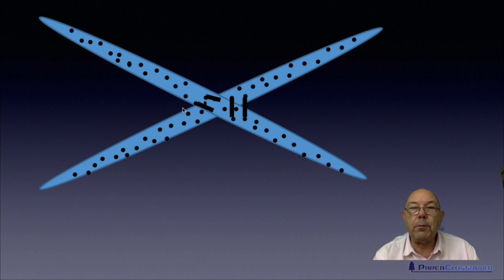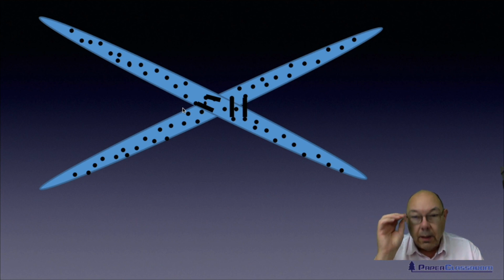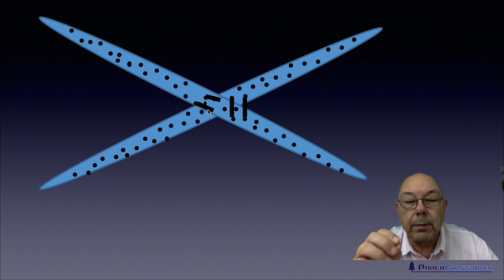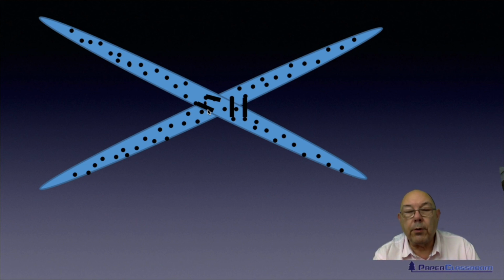Once you've made the sheet of paper and it's been dried, a reaction starts to happen. We call it a cross-linking reaction. And each of these tiny particles starts to react with the adjacent one until they connect up. So I've just thrown in four here. So you can see that a dot there and a dot here and maybe a dot here, they've all joined together. So some dots on this fibre, some dots on that fibre. Same again here, same again there. So they've all joined up. So they have now produced a bond that is insensitive to water, because all these products are very, very hydrophobic.